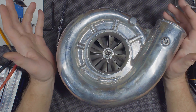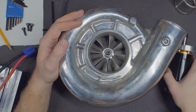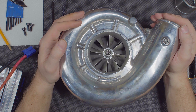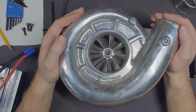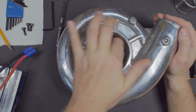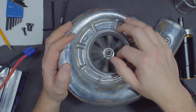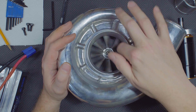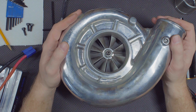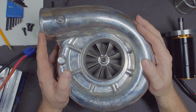It was generating effective boost. If engine consumption matches, that 1.3 pressure ratio is what we'd get — so it was actually under load. At 35 volts and roughly 200 amps, that gives us about 7,000 watts. This motor is rated for a peak of 15,000 watts and 7,500 continuous — and it barely got warm, so we know it can take a lot more. The weakest link is the ESC. We'll see if water cooling resolves it; if not, we'll need another ESC. Cables are taken care of. Everything looks pretty good — this honestly turned out better than expected. Stay tuned, there's a lot more to come and we're getting this on the car pretty soon.